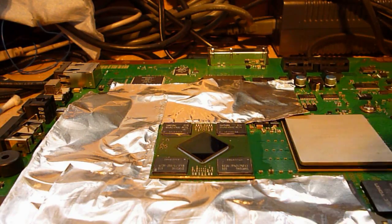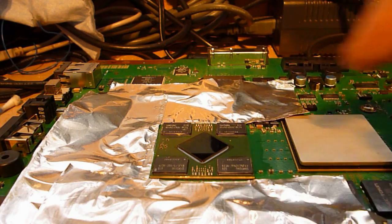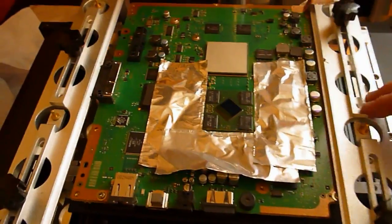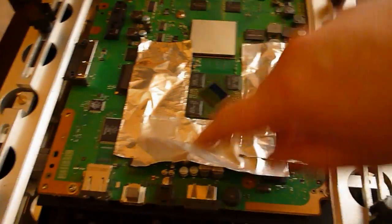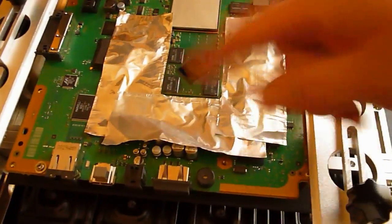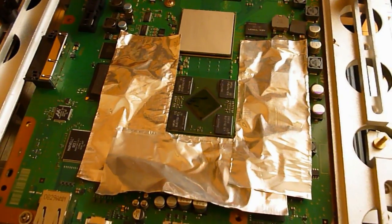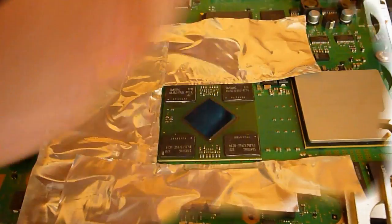I leave this bit off till I set it in the machine because I'm going to attach my thermocouple there. When I put this on the machine, I like to check across here and get this chip centered right above the center of the heating plates. I just find I get a more even heat from there, no other reason.